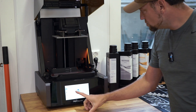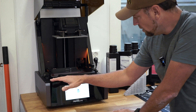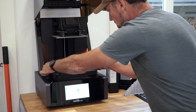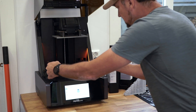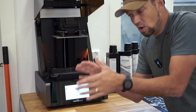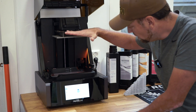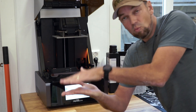Metal casing, super big touchscreen — it all feels and looks fantastic. If you're not familiar with resin printing: you have a tub in the bottom, and underneath that tub sits a screen. This is a transparent-bottom tub, so if I take it out you can see there is a screen in the bottom, and below that sits a UV light source. That screen cures certain parts of the resin according to your slicing software, then it pulls the build plate out once that layer is cured.